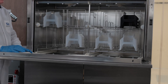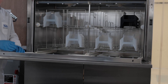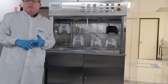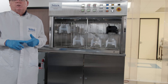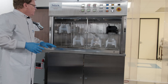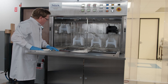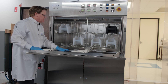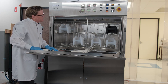Anything and everything you can see on this system, we can offer as a spare part. We are also quite busy doing in-house refurbishments — either we come to customer sites and spend a few days working on repairing their tool there, or customers send us the tools and we go through our complete remanufacturing process. To start off with the chamber, you can see this chamber looks great. The stainless steel has all been cleaned and gone through. We've replaced any of the spray arms that were necessary. It has been fully functional tested and all of the motors have been gone through.